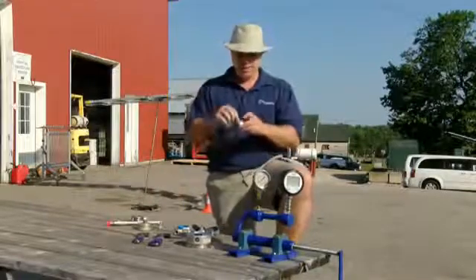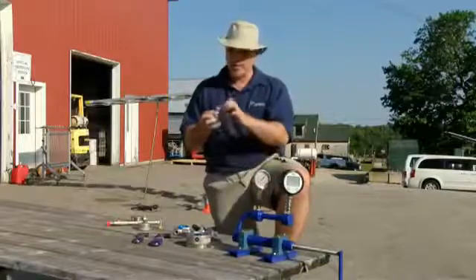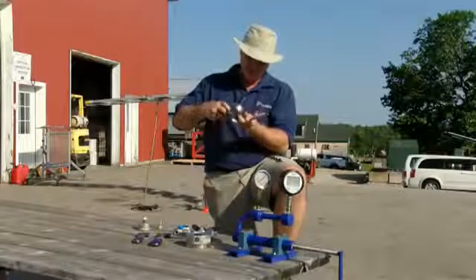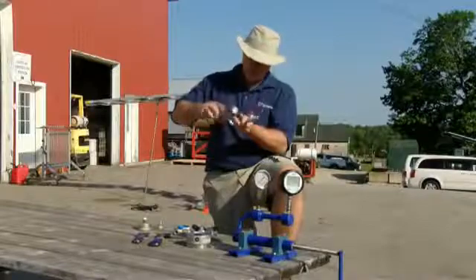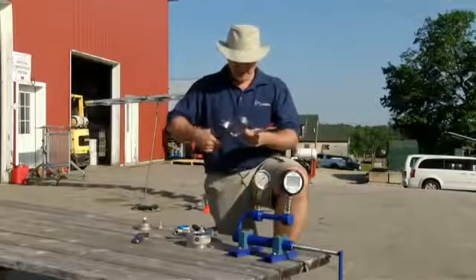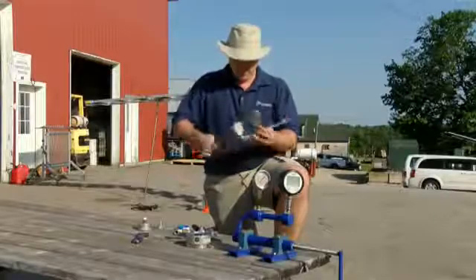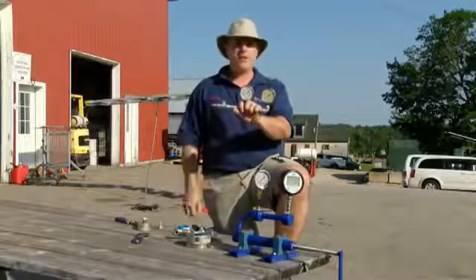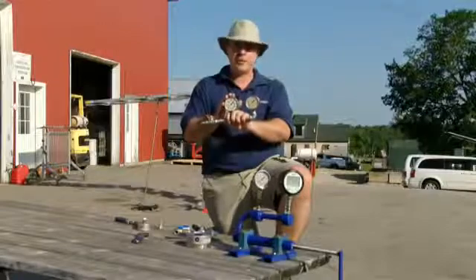What you'll do is take some Teflon tape and wrap it maybe twice around the gauge — there shouldn't be any need to go more than that. Make sure it's smooth and not obstructing the orifice. Then by hand, start to thread it. Never turn a gauge by the face. Once it starts to snug up a little bit, that's when you want to get a wrench and finish tightening it. You would then plug this into the air compressor and turn the compressor up until you get to say 100 or 150 PSI — your standard operating pressure — and compare the two gauges.